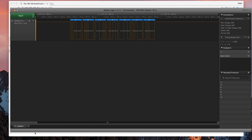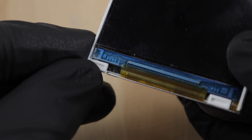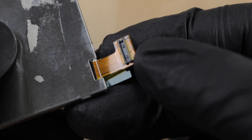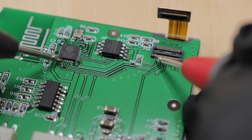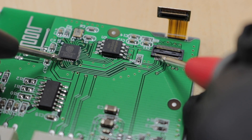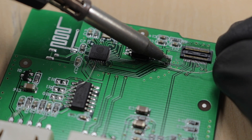To be able to write and publish a new firmware, we obviously have to figure out what kind of display they used and how we can interface with it. I did a lot of Google searching with all the part numbers I found on the display, and even contacted the display manufacturer for help, but none of that helped — there's no datasheet or specification available. So I took the hacking approach. I had to figure out what kind of bus is driving it. I was pretty sure it was SPI, but after tracing all lines I found only three instead of the four common SPI signal lines — clock and chip select, but only one data line — meaning the display is driven in a so-called three-wire SPI mode.